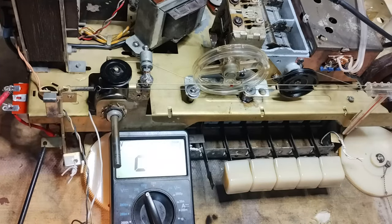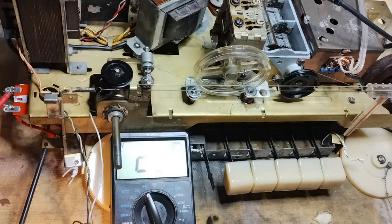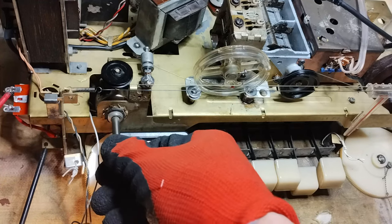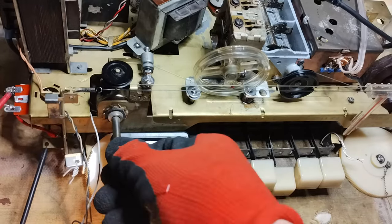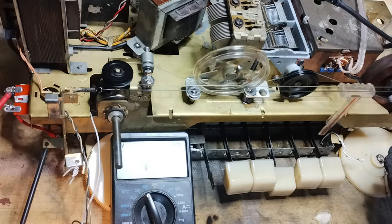After having verified how the speakers were supposed to be connected to the output transformer, a loudspeaker was connected and the final amplifier tube was inserted to test that section too. Under the circumstances, the B+ was showing an excessive ripple, reflecting in a very loud hum. However, the final amplifier was working well enough, and the normal restoration could start.